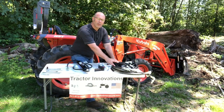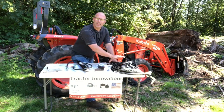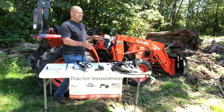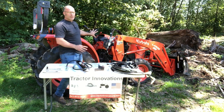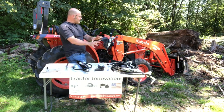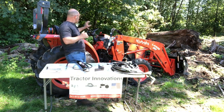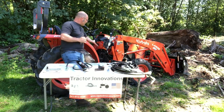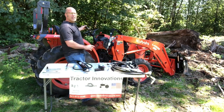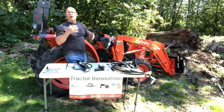What is normally a kit to add the first third function on a tractor is going to be a selector valve to create this rear remote. The beauty of this system is we don't have to touch any electronics. We've got a made in the USA valve, made in the US hoses, everything complete in this kit to allow running of a rear implement and a rear cylinder off of these electronic buttons. This switching valve is going to mount right up here underneath the loader valve. When the knob is pushed in, his electronic buttons run the grapple. When we pull the knob out, it's going to run the rear implement.